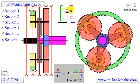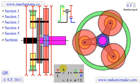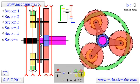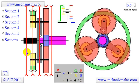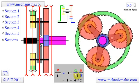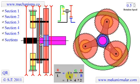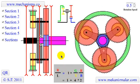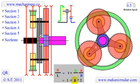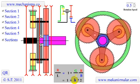We also show a graphical representation of this planetary gear mechanism. The gear ratio of the output at right to the input at left is given by the formula shown. The colors and the characters R, G, B, and Y show the number of teeth on the red, green, blue, and yellow gears. If we substitute the previously given teeth numbers — 96, 24, 48, and 24 — into the equation, we come up with a speed ratio of 9.